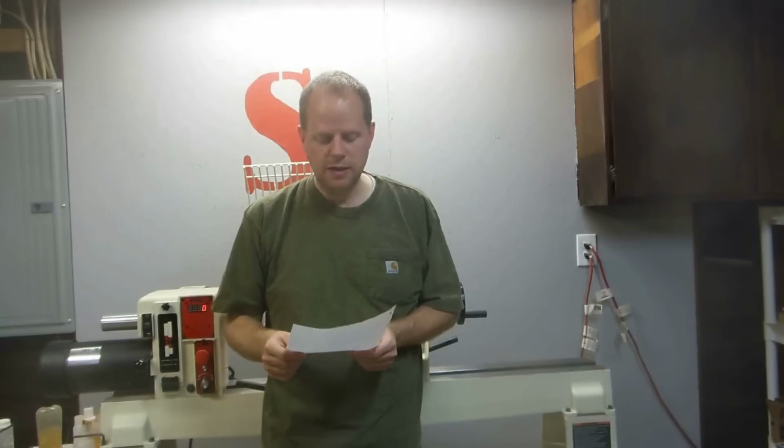On the goblet, we did some roughing with the square cutter again. We did the outside with the round carbide cutter and with the Hunter Osprey tool to show the bevel rubbing. We did hollowing with the cupped carbide tool and with the Teagle hollowing tool from the UK, and we brought everything down to the stem as if we were using a detailed spindle gouge. We used the Easy Wood detailer to bring the wood down to the stem, and we turned a couple of beads with the pointed diamond tip from Harrison Specialties.